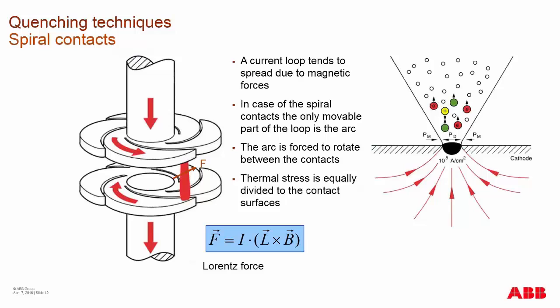The AMF diffuse arc contact system gives a very wide arcing range and is subject to what's called deposition. During fault breaking or standard load breaking when you separate contacts, you have a current loop. In the case of spiral contacts, arcing will rotate according to Lorentz's force. At the point of arcing, you see vaporization and creation of a cathode spot, which causes vaporization of material into the vacuum interrupter. This vaporized material helps continue to conduct electricity and doesn't extinguish until voltage or current hits zero.